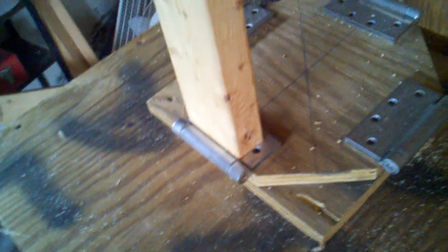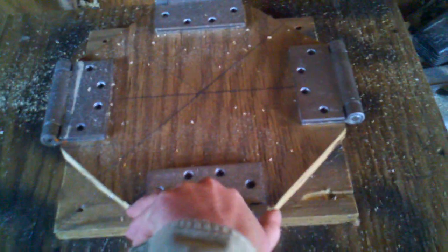Imagine there's a brace and there's a screen on here, and there's four of them out at an angle like so. The screen will come down and you do your swipe with your ink. This is a four-color press. Here will be your table for your shirt to sit on. Here's one color — after you do that color, you turn it, put your next shirt on, and do your screen print. There'll also be a bar that swings over with a heat pad or electric hot plate to dry the ink. Then you can put it back and do the next color.